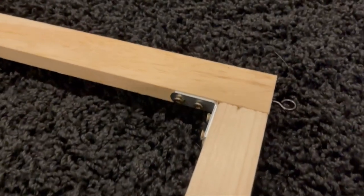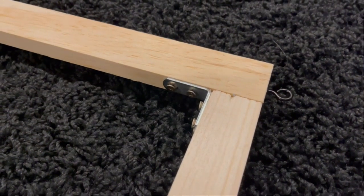All right, so I've framed up the masks using 1x2 pine lumber. As you can see, it's just the appropriate vertical length that I need. And then, of course, I've put the horizontal members in there to give it the rigidity and structure and to keep it square. Basically, I brad nailed it together, and I did add a couple of angle brackets on the inside corners just to make sure that it stays absolutely square.